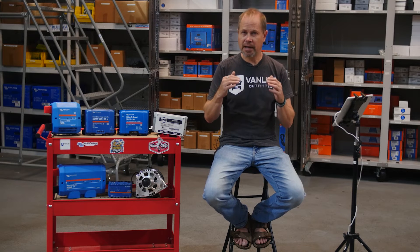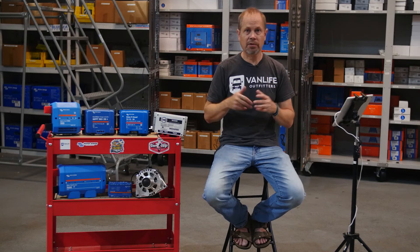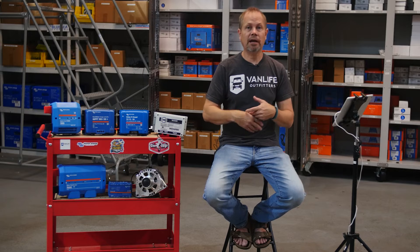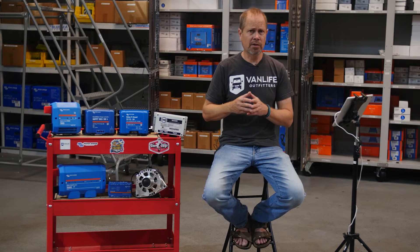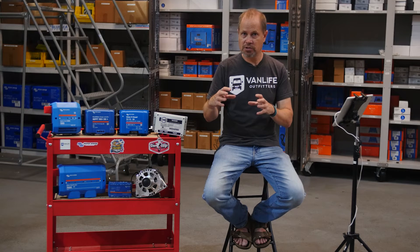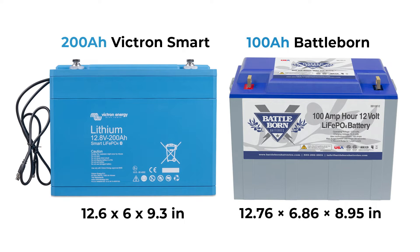Let's dive a little deeper into the storage battery component. We talked about internal BMS versus external BMS batteries — what's the difference other than where the BMS is? Internal BMS batteries, also called legacy or drop-in replacement batteries, have the BMS physically inside the battery, so manufacturers must put it in every single battery. One of the first things you'll notice is that external BMS batteries are much smaller in footprint — you get more energy storage in the same amount of space. Here's a classic example showing a Battle Born internal BMS battery at 100 amp hours next to a 200 amp hour Victron smart battery with an externalized BMS.